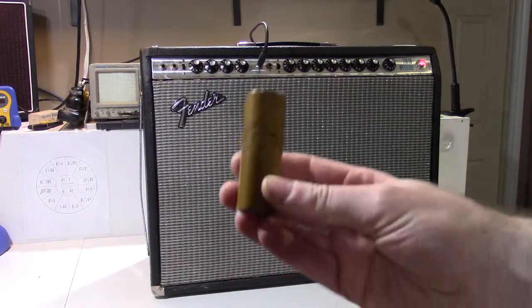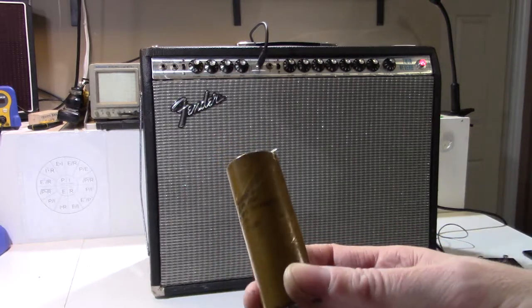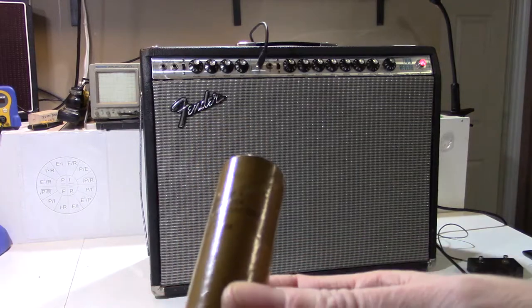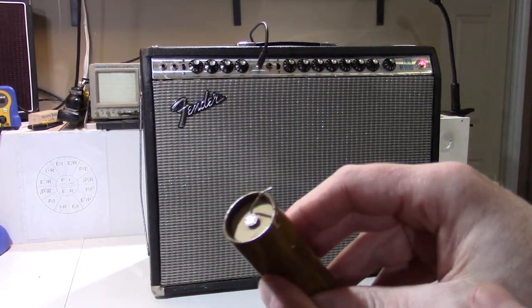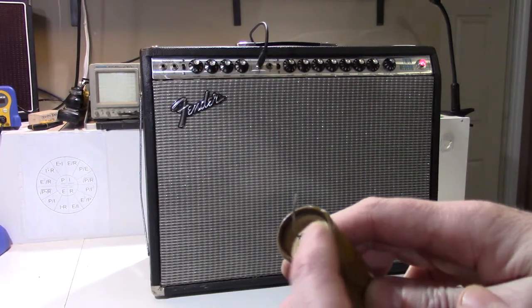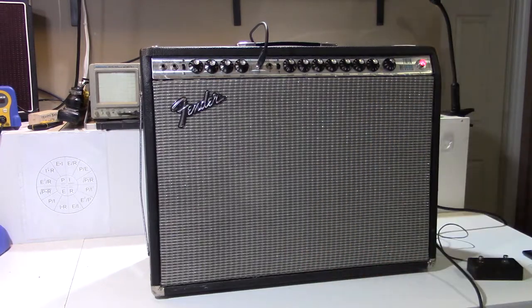I have actually one of them here that I pulled out. This was supposed to be a 100 microfarad at 300 volts DC capacitor. I don't know if you can see the numbering on there, but anyway. At the end of the capacitor, there are the sure physical signs of leakage, these bumps that form on the capacitor. I tested them all. They were all pretty far off spec. So that was one of the really major problems to begin with.